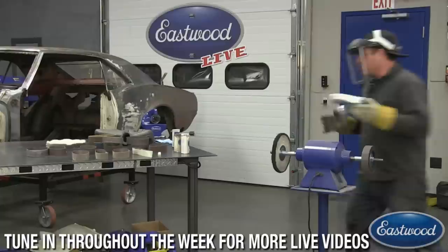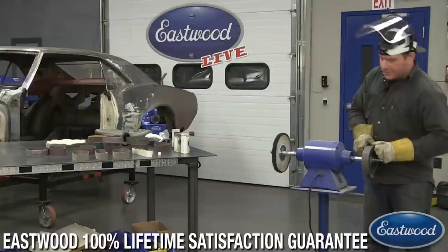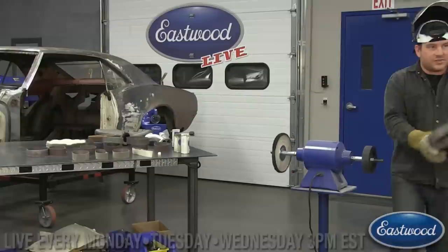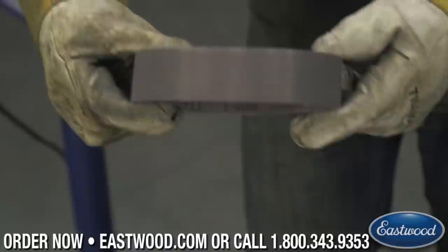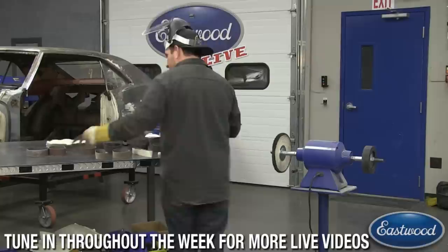You can see we're starting to get pretty smooth — there's a little bit of some spots right there. I'd probably hit those ghost lines, maybe go back a grit, knock them down quick and jump back to 400. You can read the part and use shop lights to see any remaining rough spots. That's 400 grit. Now I'm going to swap over and jump into the finer grits. The next one down is 700 grit. On the inside of the band, the grit is printed, which is great for keeping them organized.